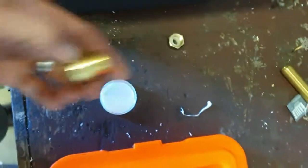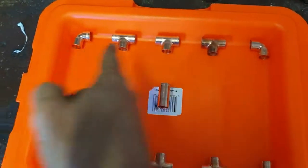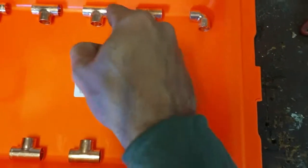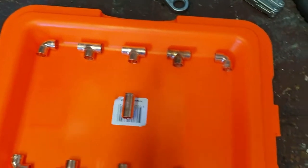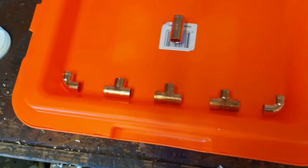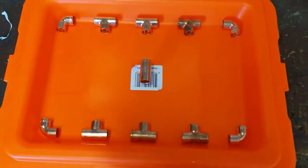I've put all the pieces out. I'm going to connect that up with this compression fitting onto that threaded bit of brass pipe there. I'm going to cut all my copper into here. I've measured them all equal distance. The copper pipe sits into these each flange here, 11mm, so there's 30mm in between each of that. It's 22mm to each, meaning 52mm. So I'm going to cut 8 pieces at 52mm, then I'll cut my two end pieces and the connector pieces.